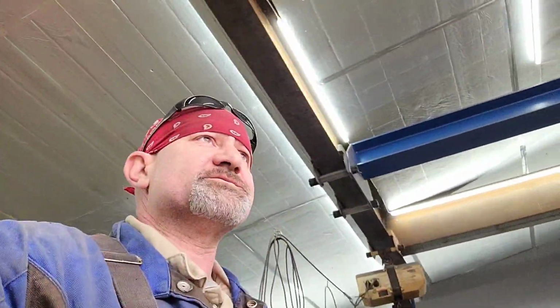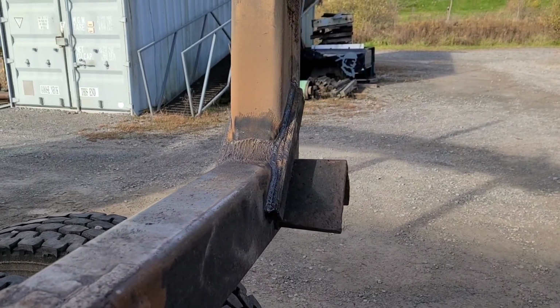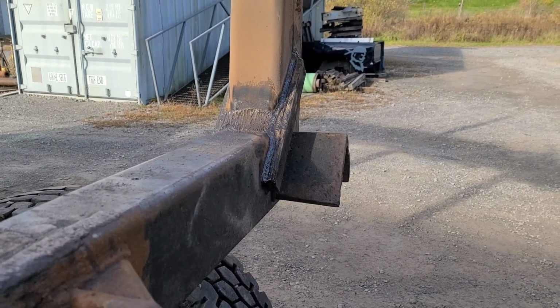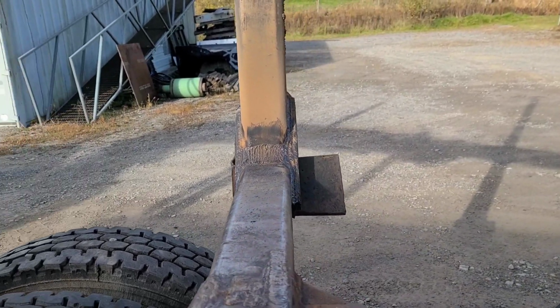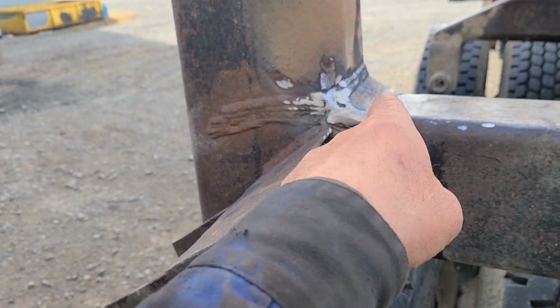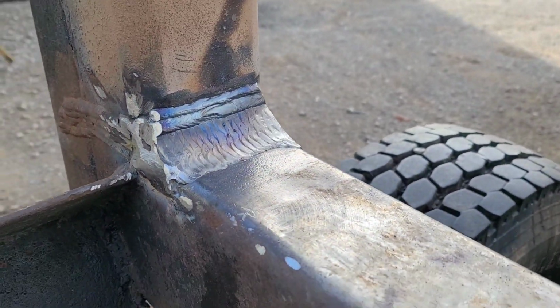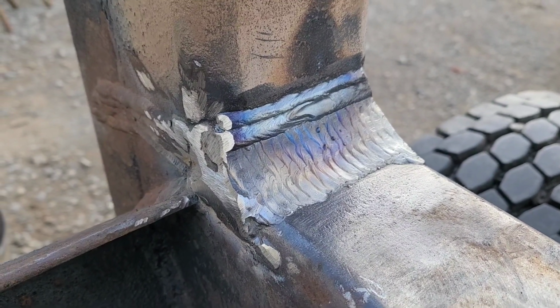Been welding cracks in this log truck this morning. It wasn't light when I started, so I haven't filmed nothing. There was this cracking in these bunks that we saw. That's the bunk air that's got, somebody put those flat bars on the side. Those flat bars should help a lot. But there was cracking, and I did a bunch of welding there. There was cracking a little bit at the bottom here, remember. Did a bunch of welding there. Kind of welded in a gusset there.